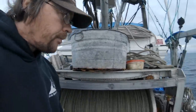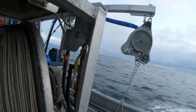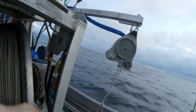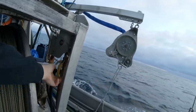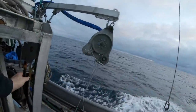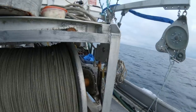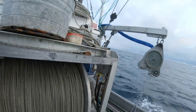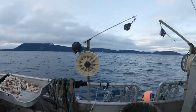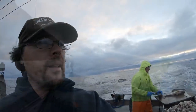We also have a valve right here — this is a cutoff valve. If we have an emergency, you could just reach over here and turn off the hydraulics, which cuts the flow of oil to the motor and stops the drum. So if a guy somehow got tangled up in the line or caught by a hook and was getting pulled up to the reel, he could probably reach over here and grab that real quick and stop it. Same thing for somebody working at the table — they can just take a couple of quick steps and reach over here.